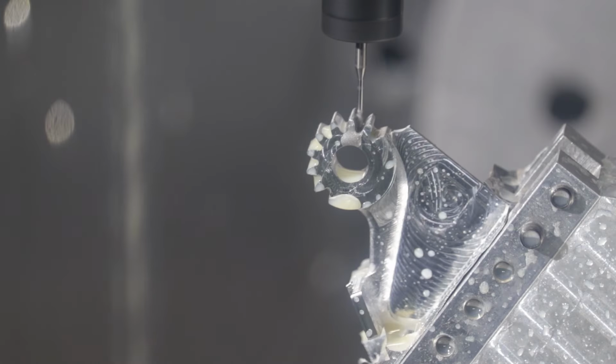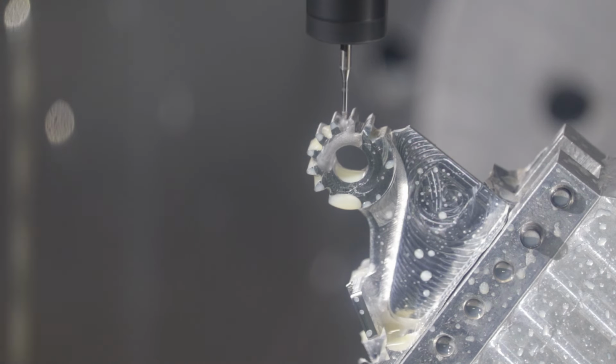And basically we are putting the sharp corner bottoms of the teeth in at this moment. The previous operation with a 1/16 inch end mill that was orthogonal to this cut was cutting in the actual gear tooth profile. I forgot what standard of teeth this is, but this is really just kind of finishing off as the tooth dives into the base of the gear, and we're cutting or machining the square bottom corners of the teeth in.